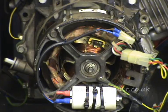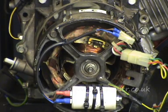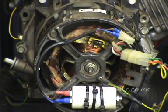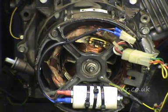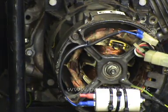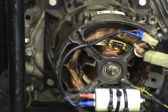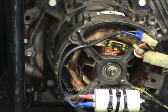If you're just getting zero output from the sockets, the next thing to do is give it a little rev — a quick blip of the throttle linkage. Sometimes if a machine has lost residual magnetism in the rotor, just giving it a quick rev will be enough to restore that and get the whole generating process going again. If that doesn't work, you need to measure what output you're actually getting from the sockets. If it's showing, say, 110V out of the 220V socket, that can be a clue.